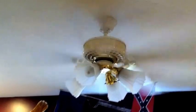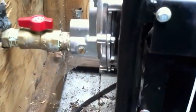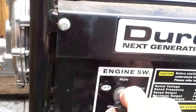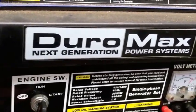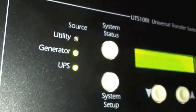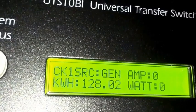Now I'm gonna hit the generator on and see what's on those other circuits — one, nine, and ten. I believe it's the kitchen though because everything else seems to be on. I got the propane connected. Everything's on so I'm gonna give it a prime — a couple taps — and we'll see. Okay, so now the generator's online, as you can see — generator and the UPS are online, utility is not.